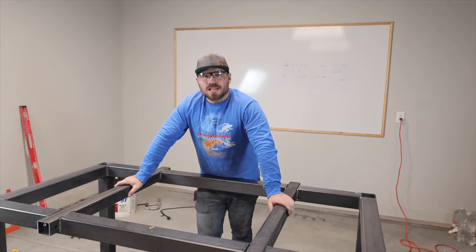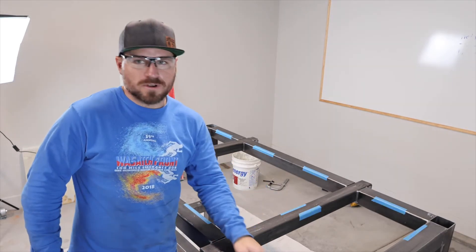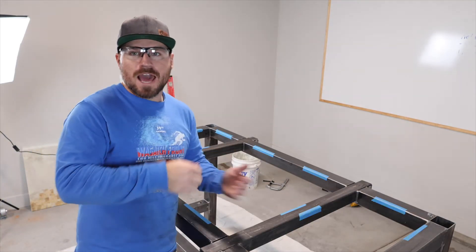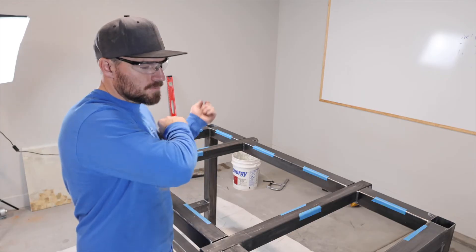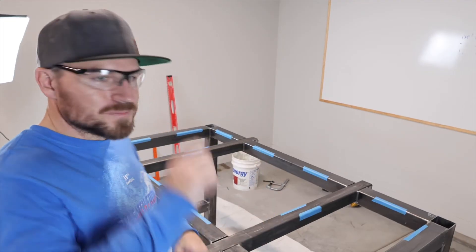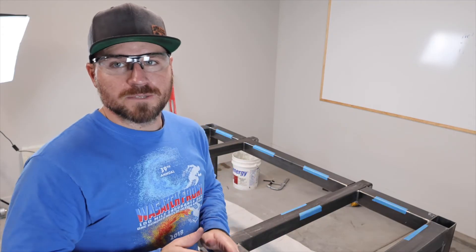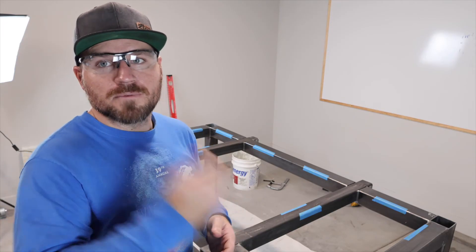At that point I just have to slap the tabletop on and I'm done. I'm ready to paint now, and what I've done is just take some tape and put it on a couple of corners. I probably did way more than needed, because when I put the tabletop on I'm just going to reach in from the underside and tack it on there. I don't want to fight through paint underneath to get my welds in. I'll shoot all the paint over top, peel the tape off, and put the tabletop on. If I had to make one suggestion — if you're making or fabricating anything, always primer. Primer really smooths out a lot of things and makes your paint look significantly nicer.